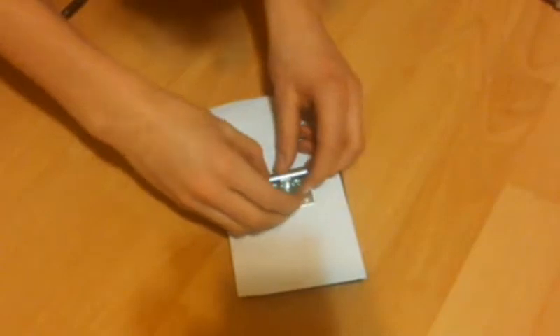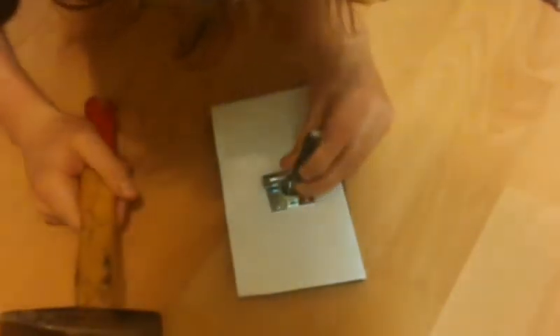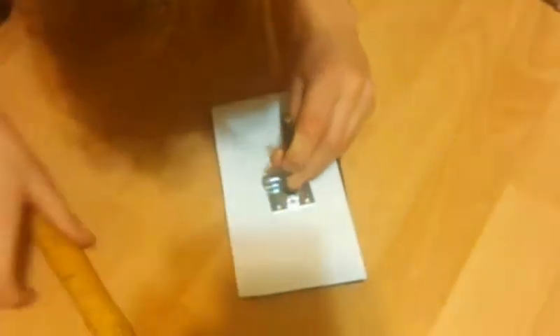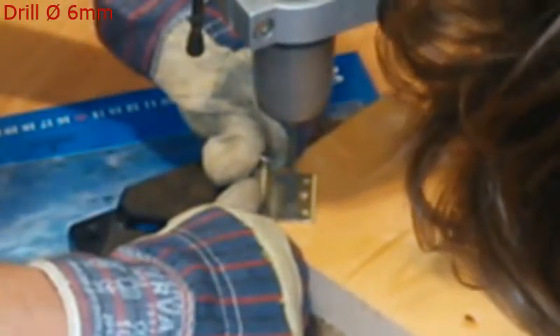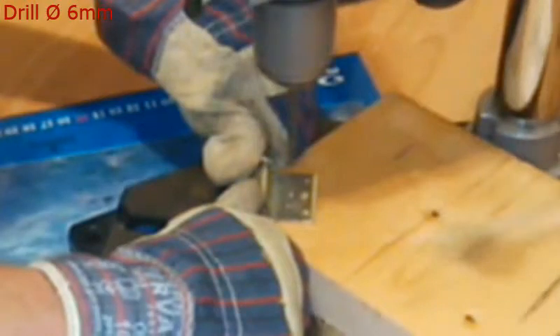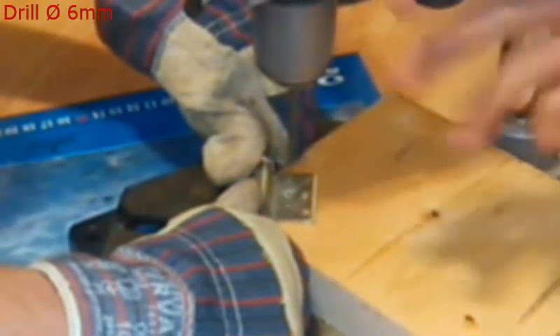On the hinge I've put a 12 mm nut and in the very center I've hammered a small hole. I've used it as a mark and I've drilled there a hole using a 6 mm drill. But that hinge was actually made from stainless steel, which is really hard to drill, so I found it necessary to add some oil.